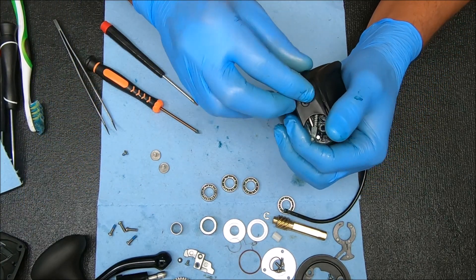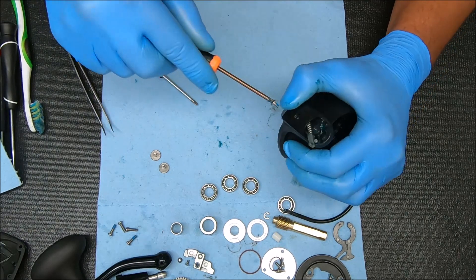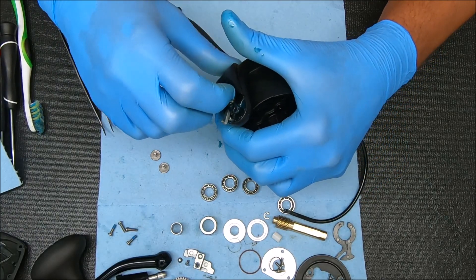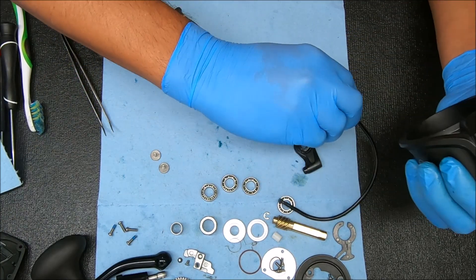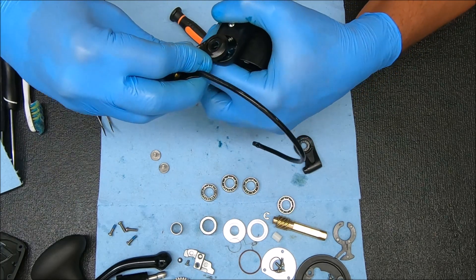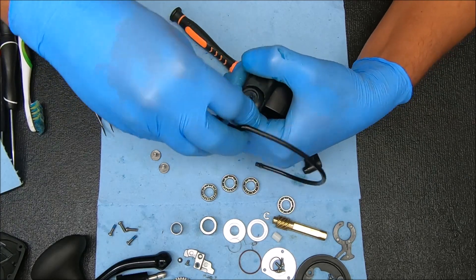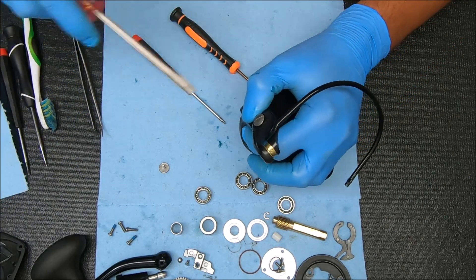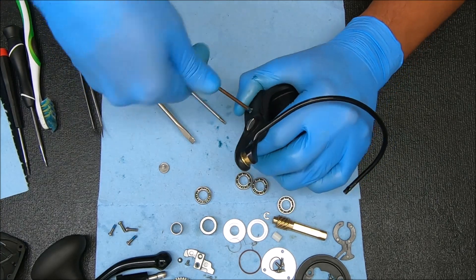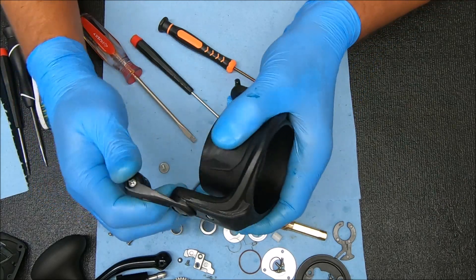I'm going to cover this up and secure the cover with this screw. I don't go all the way down to the bottom — kind of leave a little bit of play in that cover, just in case I need it. Now take that hole, put it over this piece, at an angle, kind of rotate as I push down. When I get to the bottom, make sure it's secure. Now we're going to secure it with the screw, and do a double check on the trip arm just so you can see it. Let's screw this cover down so there's no play in the bail spring.